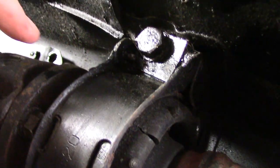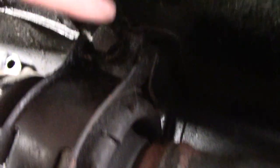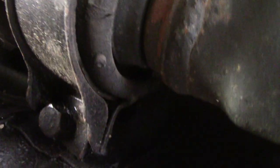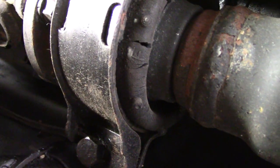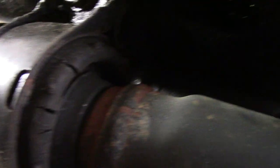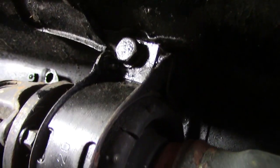At the moment there's a donut bearing supporting the middle of the prop, which sits too far forward by an inch. I've done a bodge to make it work — probably a pretty good one that'll last — but the donut bearing is tilted about 10 degrees off. That rubber donut is going to wear out; the whole thing doesn't really work and isn't fit for purpose.